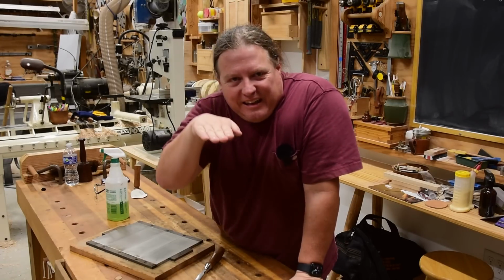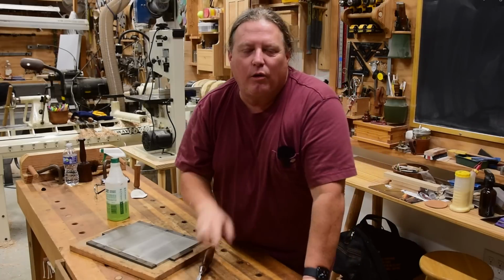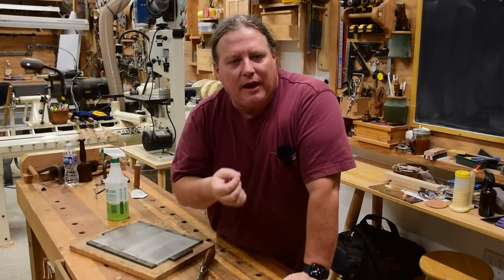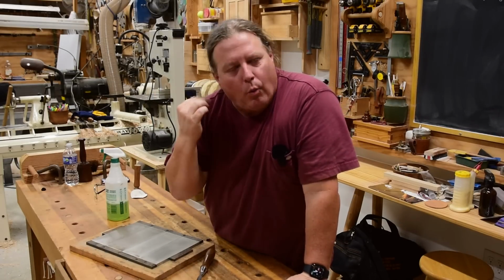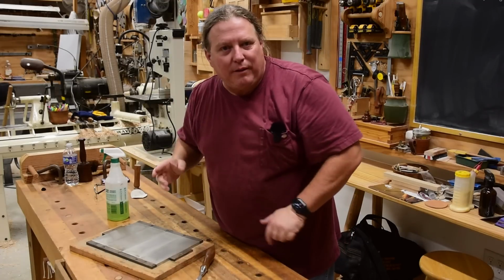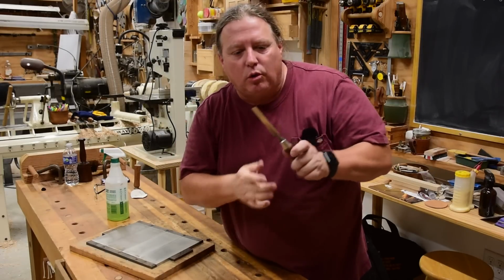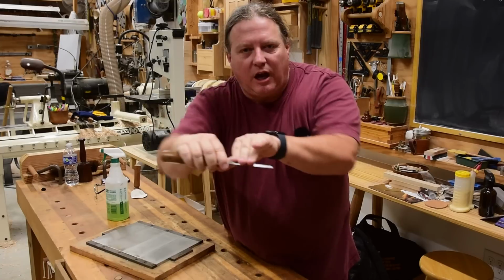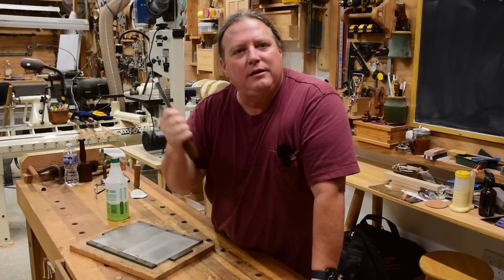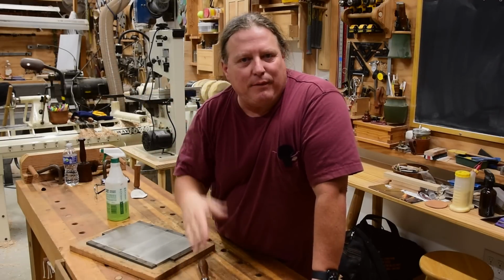It was still flat to this day, even though all that sharpening he's done. Where most oil stones get a dish in the middle because most people just go back and forth either with a jig or they've trained their hand to do that, so they only wore out that one section. But what was remarkable was the speed that he sharpened it, and it got me questioning, why was that? Well, that's where I came up with the idea that it was a cross pattern. Because even in my own sharpening, when I was tuning up a lot of tools and doing backs of hundreds of tools, just going straight took forever. But if I was constantly changing the angle, I flattened quicker. And that was just because of repetitious, stupid, dumb luck of figuring that out. But questioning why on that earlier video gave me that explanation.